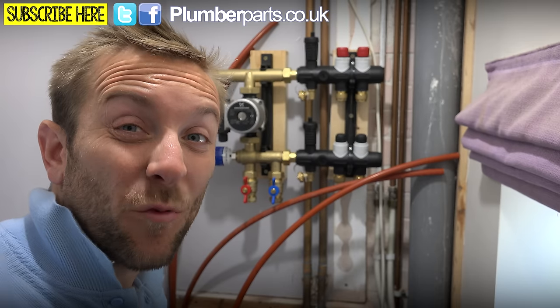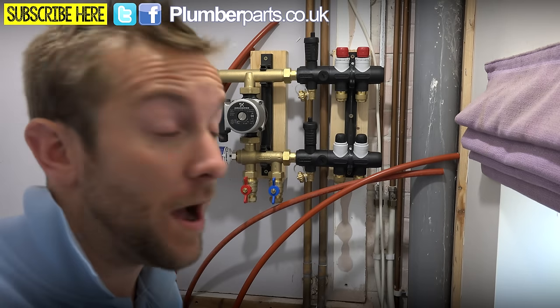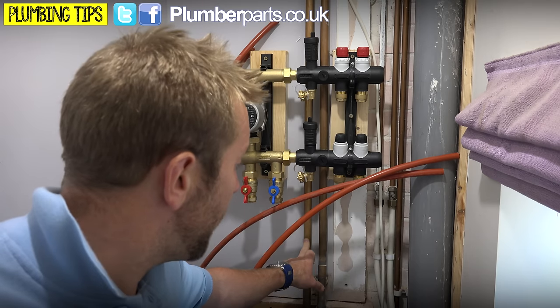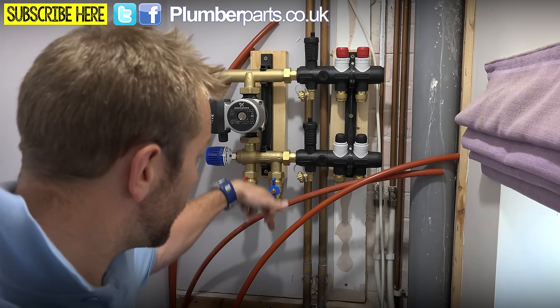So as you can see, it's not really position A when it comes to where you'd usually install a manifold, but we covered that, as I said, in the video beforehand. So what I've got to do now is I've got my heating flow and return here. That's my flow pipe and that's my return pipe. They've got to go into these two valves just here. So your flow will go into there and your return will go into there.